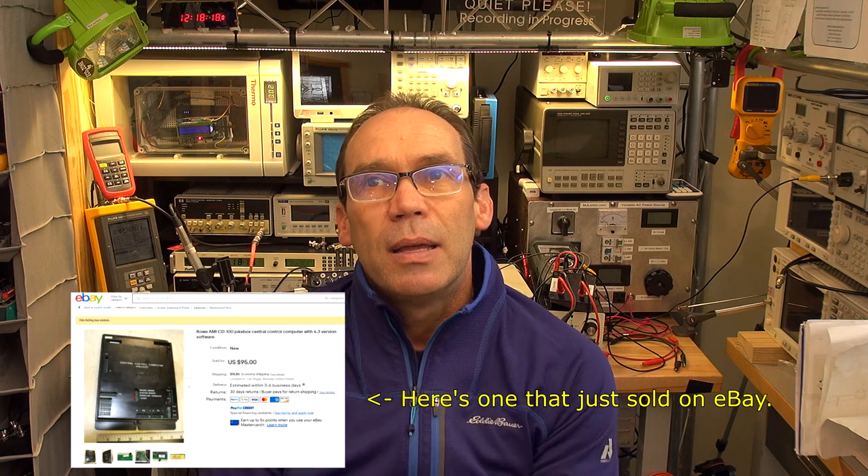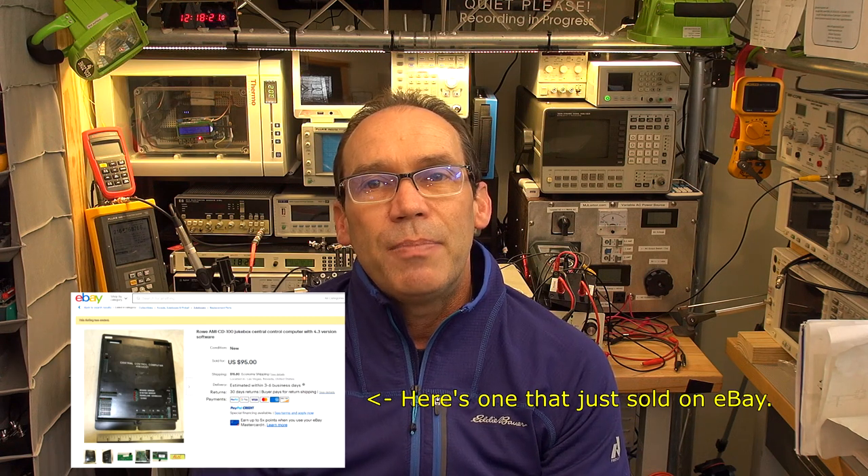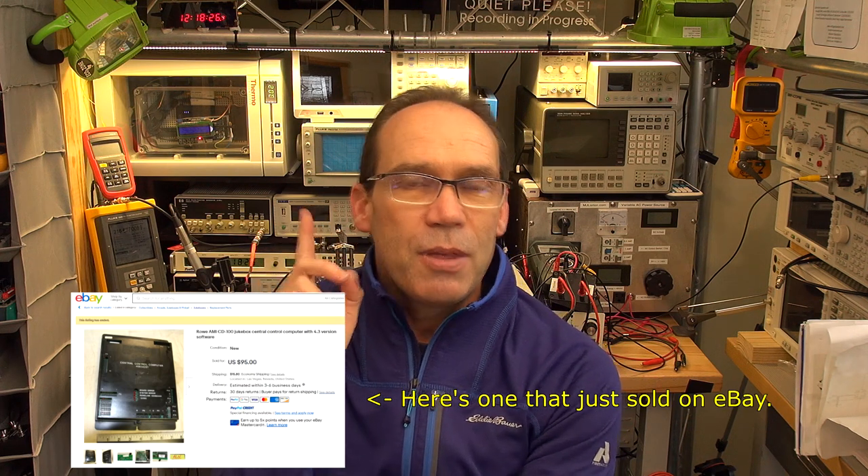A week ago I was looking at this thinking I'd have to find a new central control computer. But then something registered in my head. I was looking at the title page unit mechanics - looking at one of the micro switches - and something I'd read in the service manual registered. That led me to try something which ultimately fixed the problem. But before we get to that, let me go into the actual wiring and the logic control to show how I thought it all hung together.